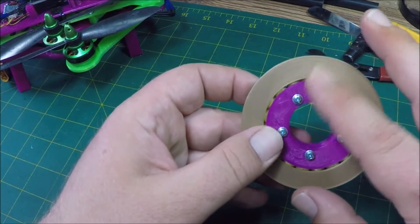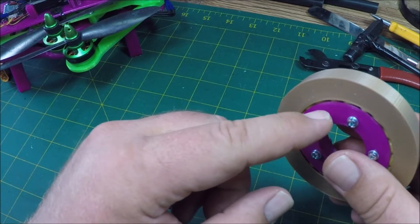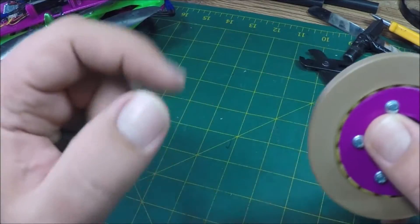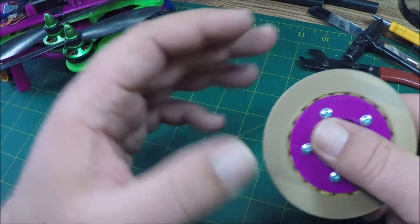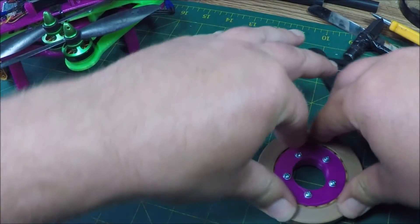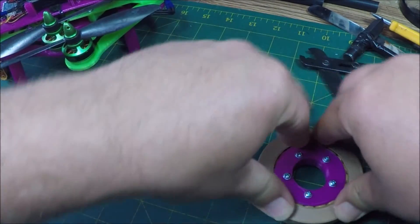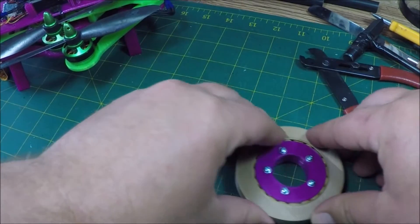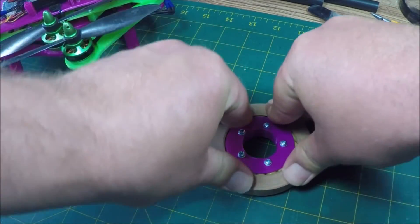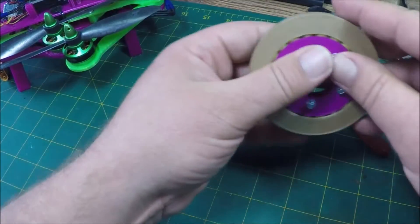Now it is a bit tight the way I made this. I could actually add another 0.05 millimeter gap in the grooves here, and this would probably end up being a lot more freewheeling, but I don't really need that. The thing is, if I press really hard on this, it turns really, really easily. There's no resistance and I'm really pressing on this — I'm going to even stand up and really bear down on it. And it turns beautifully easily. This is a really great design.